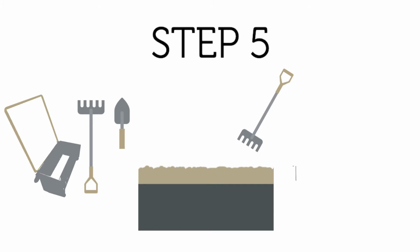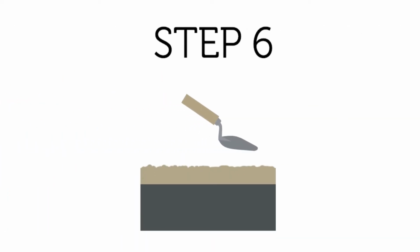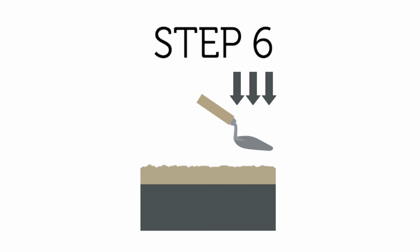Care should be taken to ensure that the correct thickness is applied across the application area. The surface is finished with a hand trowel to a smooth finish. Pressure must be applied to the resin-bound mix whilst troweling to ensure adequate compression and the required mechanical properties.